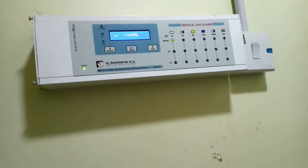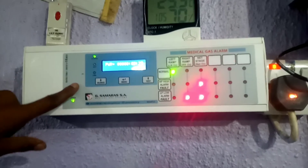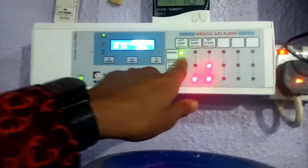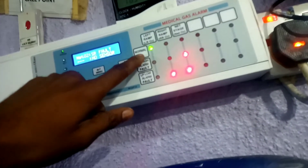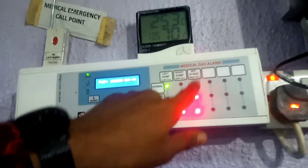So this is the difference between when there is oxygen and when there is no oxygen. This is a different panel of the oxygen alarm. We are normal at the left here because the bottle is placed at the left side of the manifold, so the left-hand side is showing normal. But the reason it's beeping continuously is because of the next stage.